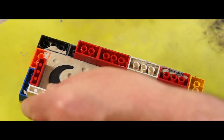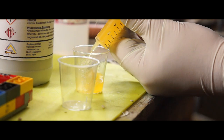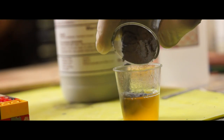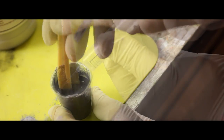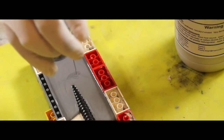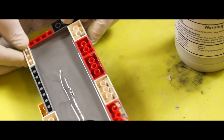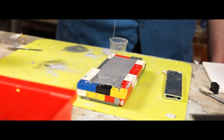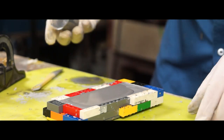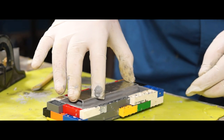I added another layer of Lego and gave everything a good coat of Vaseline, taking any excess off the grub. To use the two-part resin I measured out a small amount of part one and roughly the same amount of aluminium powder, then after mixing these together I added the other part of the resin. After mixing I poured it on and ran it round the mold a few times to get rid of any air until it began to set up and gel. Then I could add a second thicker layer to top it up. Once that had gelled I poured on another very thin layer and added a piece of aluminium kitchen trim that I'd drilled some holes in, to act as reinforcement to save adding more resin.